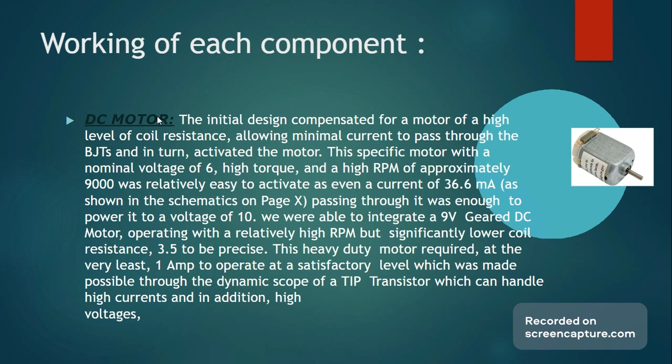But according to the parameters we discussed earlier, though we met the requirements for voltage across the load, our DC motor, it was also required in cohesion that we achieve a high current value for the load as well. Given that the maximum allowed was 2 amps, it was then further elaborated by our lab instructor that a minimum of 1 amp must be achieved for our circuit designs. So, with a few adjustments in resistance throughout the circuit configuration, mainly lowering it in different places so that the current values increase, we were able to meet that requirement.